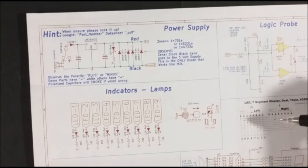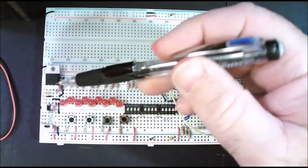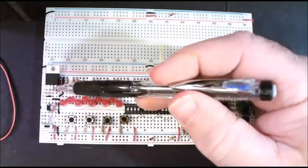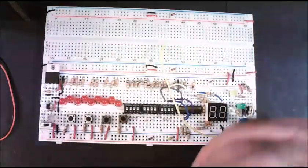So let's begin the actual build. The voltage regulator, the 78M05 — what it does is it takes your 9-volt battery and gives it a haircut and turns it into 5 volts. All these parts on your board do not like more than 5 volts. So if you hook your 9-volt battery up to them, you'll more than likely destroy a lot of parts.